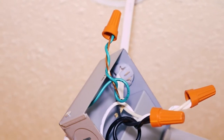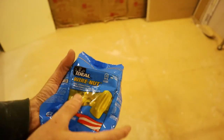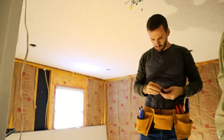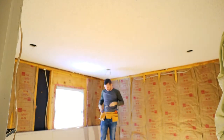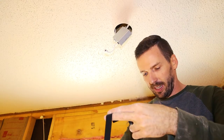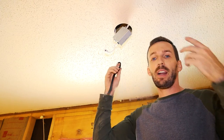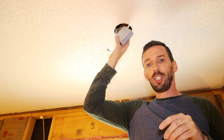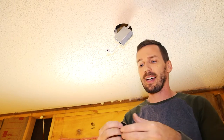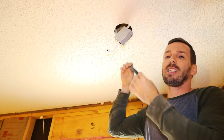I'm going through this — black to black, white to white, green to green. The wire connectors they give you are pretty small, only meant for hooking up one light. Since I'm connecting three wires together, I use these yellow ones. Just make sure they can hold whatever gauge wire you have. One thing I've been doing differently with these recessed lights: after I've got everything wired together, I tape this box shut with electrical tape, just because it's only held together by a little groove — not screwed together — so the tape helps hold it all together.